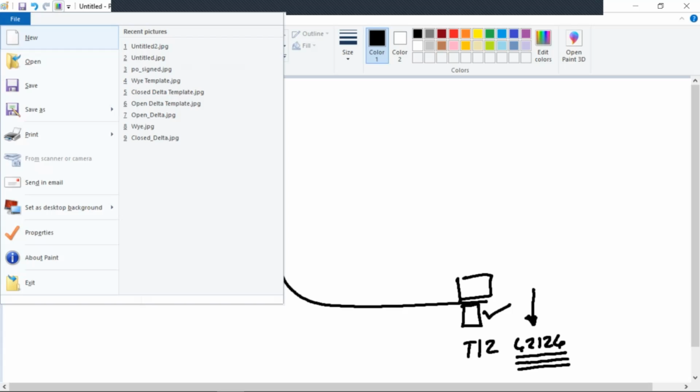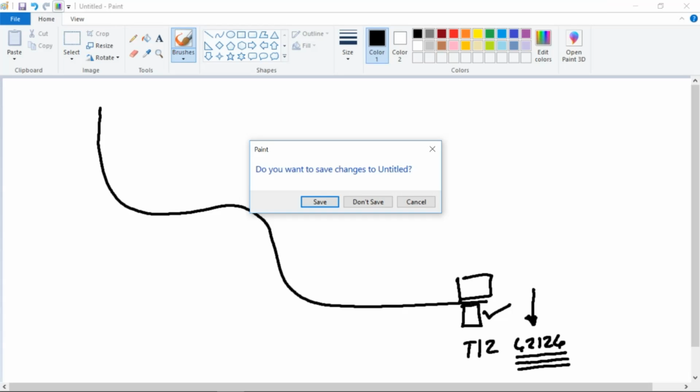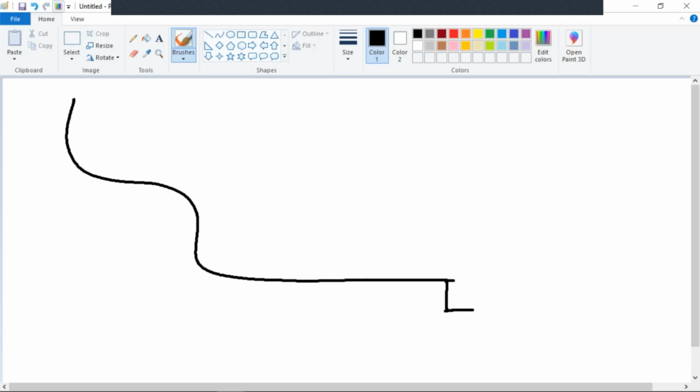Okay. So have you ever, with the mobile mapping, pulled up to something and it's supposed to be a three-phase transformer and it was something else? Nothing that critical. We have come to situations where you come down the road, and on the mapping system it follows the line, and there are other transformers down through here. What this A designates is that it's on A phase, and it just follows you on mapping. So if this transformer is connected to that, it should be on A phase, and you've done some testing or needed to confirm something and it's actually on B. Sometimes you'll run into situations like that.